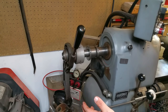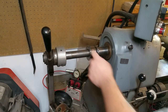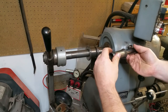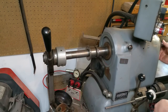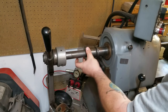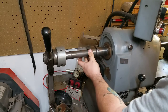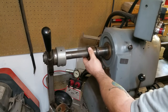There are a few things you need to know about this. You've got your draw tube, and the inside of the draw tube is threaded — it's the same threads as on this collet here. So this screws onto the end of the collet, and that's what draws it into the spindle. This right here is an indexing ring that allows you to lock the turret down. This indexing ring fits on a key that's on the end of the spindle, and it just slides on there.